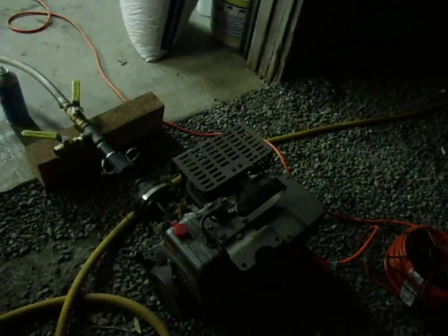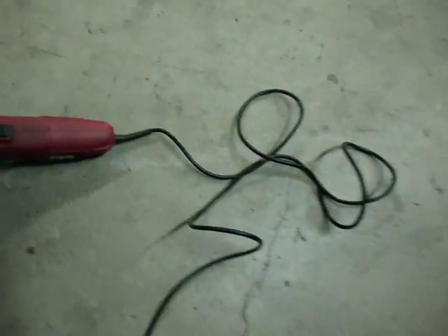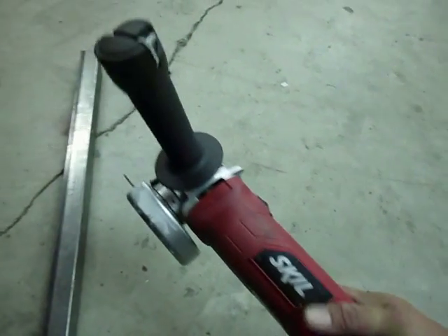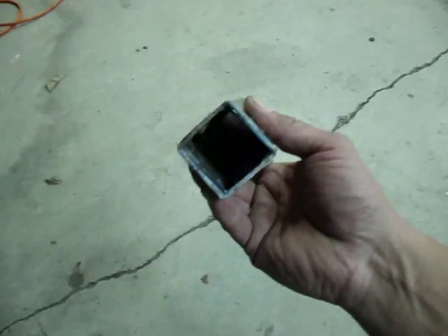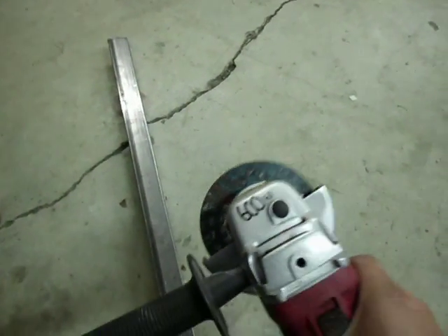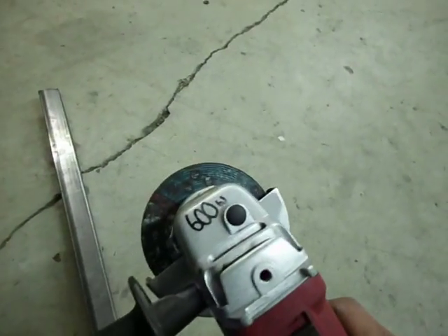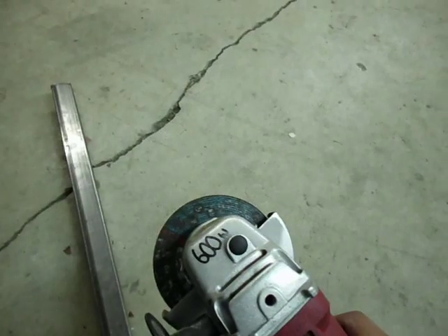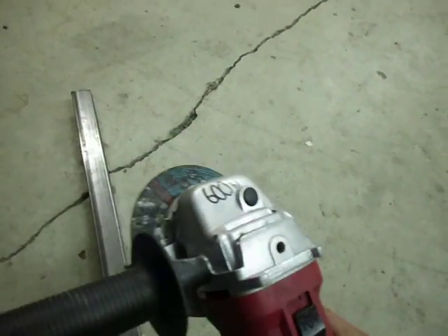I want to do a load test on wood gas. I've got an extension cord plugged in and it goes into the shop where it's plugged into a grinder — a Skil brand four-and-a-half inch grinder with a zip cut disc and a piece of inch-and-a-half by inch-and-a-half thin-wall handrail. What I did was plug a power inverter into my battery bank and run all my corded tools at free spin and then under load, marking each tool with a sharpie for how many watts they drew. This grinder draws 600 watts under load.